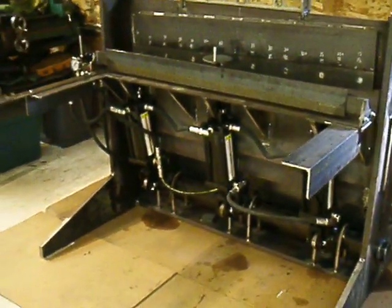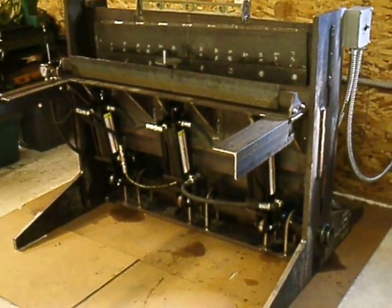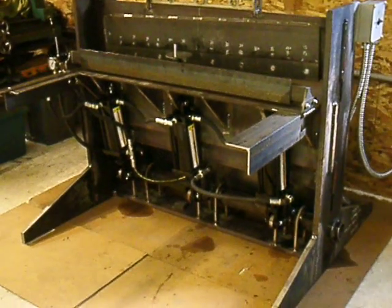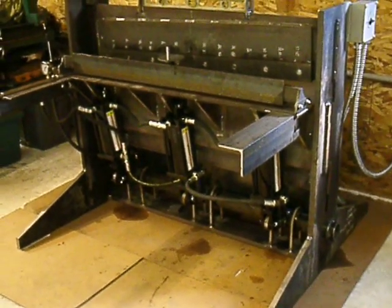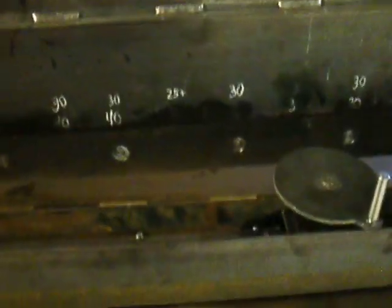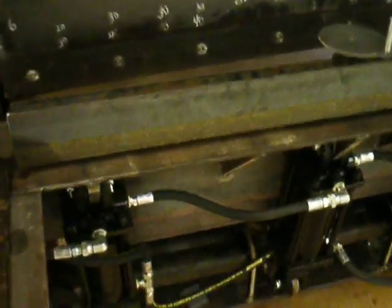So I figured up what it was going to cost to make this and decided I was just going to build one myself and go that route, so I at least have a brand new one when I got done. I had to buy the top knife and the bottom knife from a place called Federal Knife in Indiana. They sell shear blades, so that was about the only thing that I couldn't fabricate myself other than some of these obvious parts.